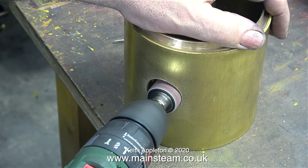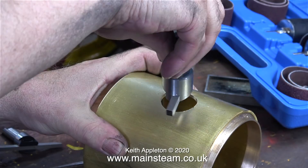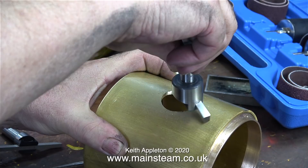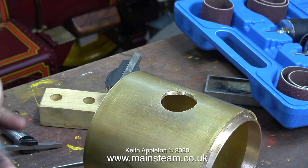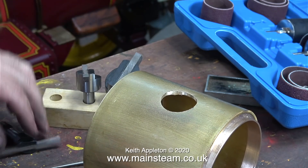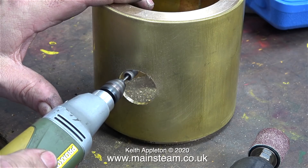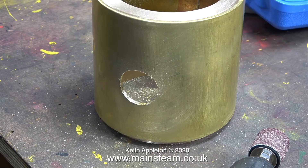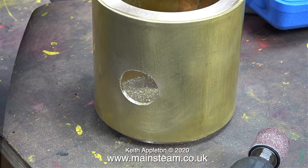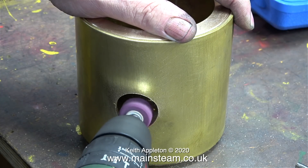For me, saving time is always a consideration. I could use a fly cutter like this one, but I would have to modify the tool to cut the correct diameter hole and carefully clamp the smoke box to the milling machine table — all of which takes a lot more time than the way I'm doing it. I don't recommend doing it with a diamond cutter fitted to my Proxxon motor tool because it works loose all the time. This is okay though — it's a grinding wheel fitted in my small electric drill.